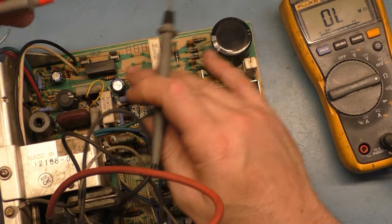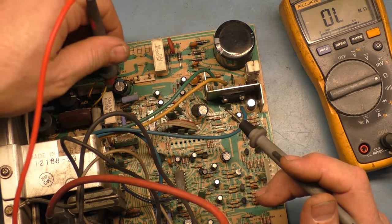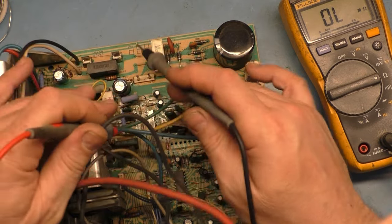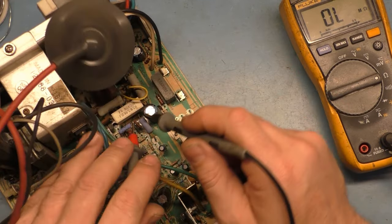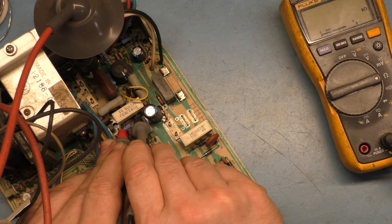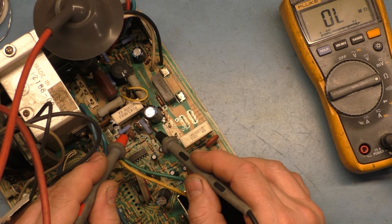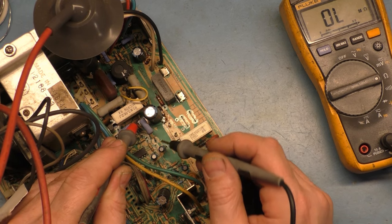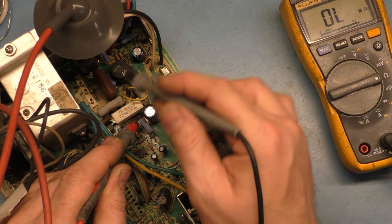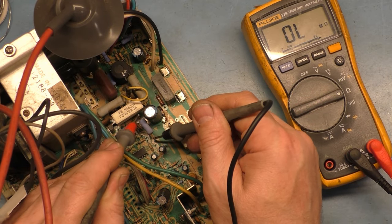Let's check R89. That should be 3.9 ohms. And it's this big white ceramic resistor here. I'll try and sneak in on this side. And then here, and we get 3.9, exactly what it's supposed to read. R101 is this guy right here. It should read around 4.5 K ohm in circuit. It's a 6.5 K ohm resistor, but in circuit with everything else, it's going to read about 4.5 is what we're looking for. So we get...